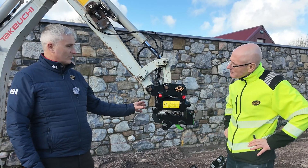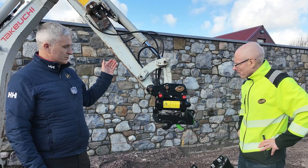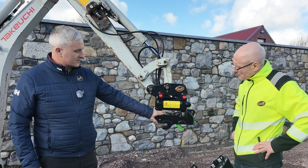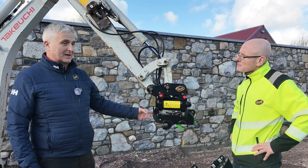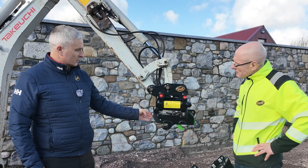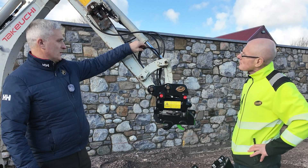It's a hydraulic coupler, so the base is hydraulic and the tilt section is hydraulic, so you need two sets of lines to connect this coupler to the machine. On the base, which is the section that picks up on your attachment, the coupler is pre-plumbed to the front of the coupler — that's pre-plumbed in the factory — so it makes it a lot easier for the installer to put this on the machine. You do need to connect jumper lines from the front of the coupler and loop up here into a dipper block on the machine to connect it into the quick coupler lines.